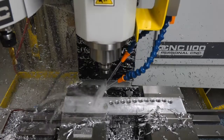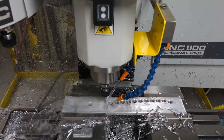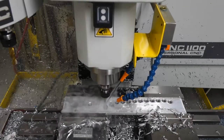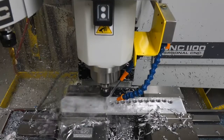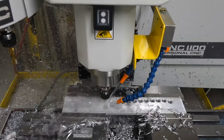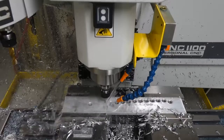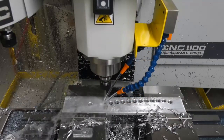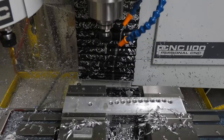Here's a quarter-inch hole at 5,140 RPM, which is the max RPM of the machine. Also 5 IPM feed and a peck of 40 thousandths. For the smaller sized drill bits, I use a full peck instead of the fast peck — I find it clears the chips better.